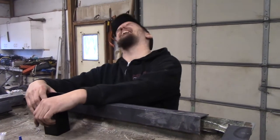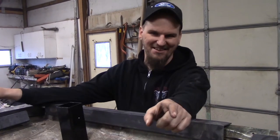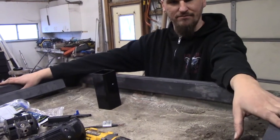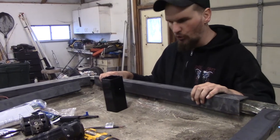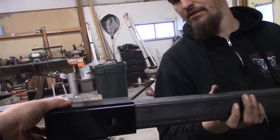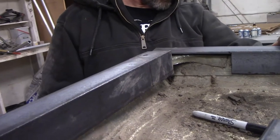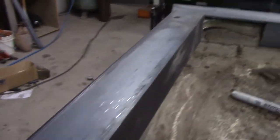Andy's going to explain the plan — bear with us. We've got this angle iron we're going to put on the side of the boat, weld these two together, and bolt it to the boat. Then we're going to drill a hole in here so we can take this in and out. We're going to have another piece of tubing going right here so it's going to be in the shape of a T. We take it out to load the boat, put it back in to go. There's a little bit of curvature on the corner of the boat, so we cut out a little piece of the angle iron to fit it in there flush, and we're going to weld the front piece onto the side piece.